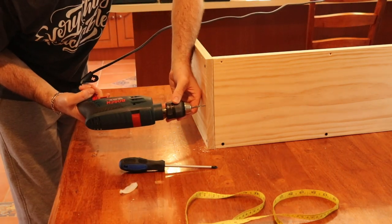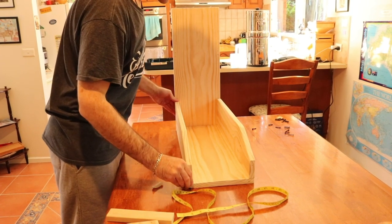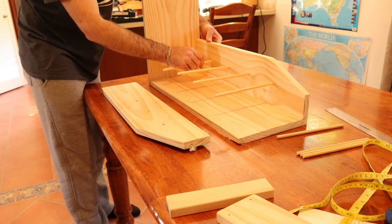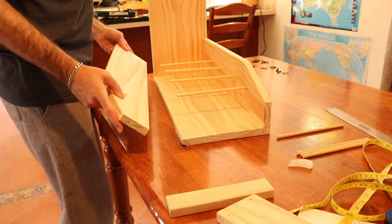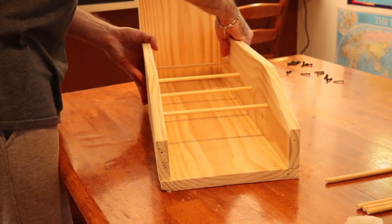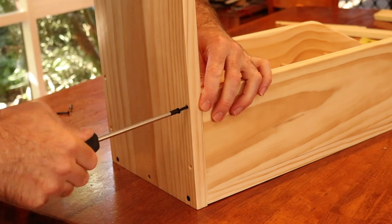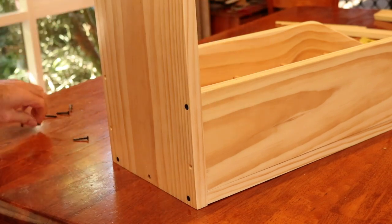Now he's got the other base side piece and that goes on the side. But before we actually drill that in, we pop the horizontal dowel pieces in — they don't need to be glued, they wedge very nicely into the holes we've drilled for the dowel. Once your other side base piece goes on and the dowels are wedged into those holes as well, it's very stable and there's no need for glue. The only time we use glue is at the front dowel pieces where it needs that little extra help. Fit all of those dowels into the holes on the opposite side until it all seems stable, then finish off the screws at the back. This reed holder cost us about 30 Australian dollars in new timber — it's a very cheap option because they're quite expensive to buy ready-made.